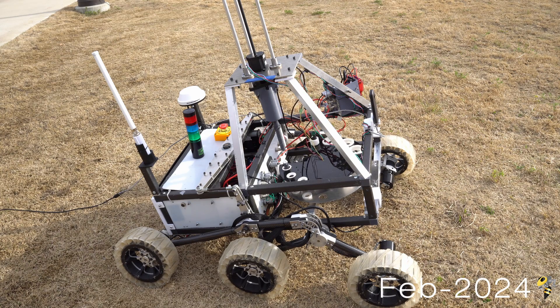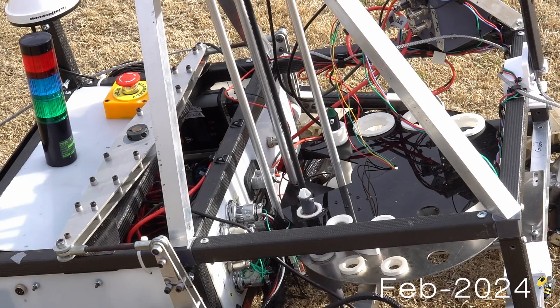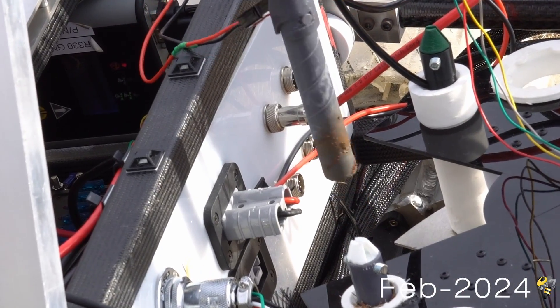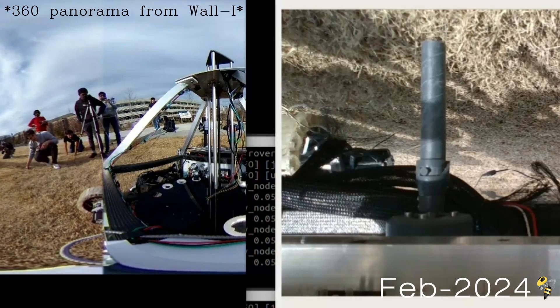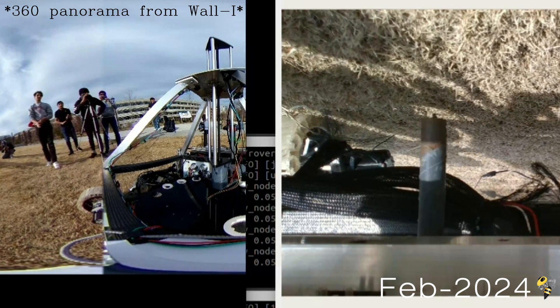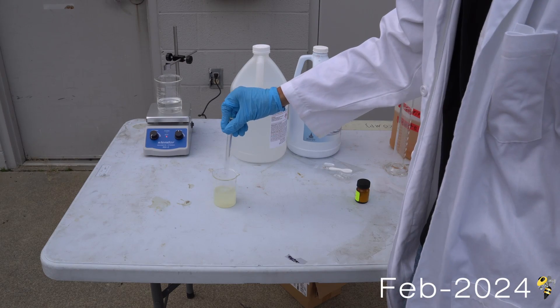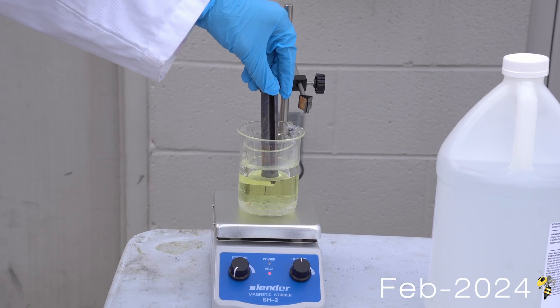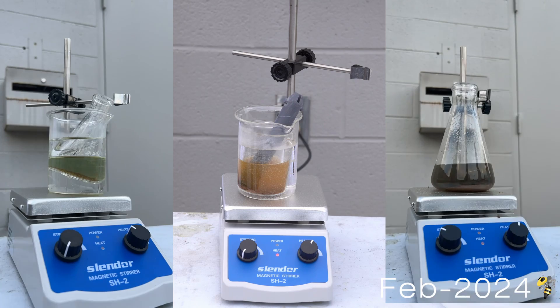Our rover features a turnstile with four interchangeable coring mechanisms, three beakers filled with a life detection assay, and one sealed cache container. Wall-E drills into the soil with a core bit, extracts the sample, deposits it into a beaker, and then drops a temperature and humidity probe in the hole to gather more data. While the core is being extracted, an onboard camera captures the stratigraphy of the sample, and a 360-degree camera captures a wide-angle panorama shot of the area. For the life detection assay, we're using a ninhydrin-ethanol mixture. The cores will be placed in the mixture, and if there are alpha amino acids present, it will turn Ruhemann's purple. Since alpha amino acids are mainly a byproduct of life processes, detecting them provides a strong indication of life.